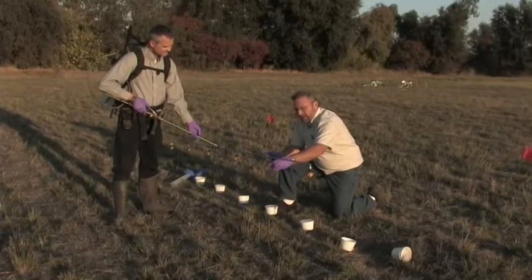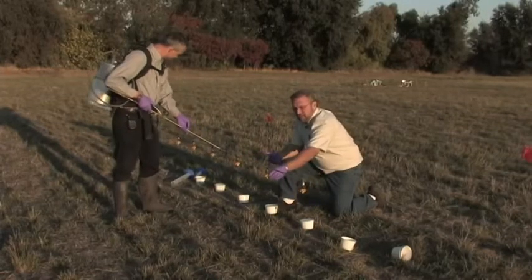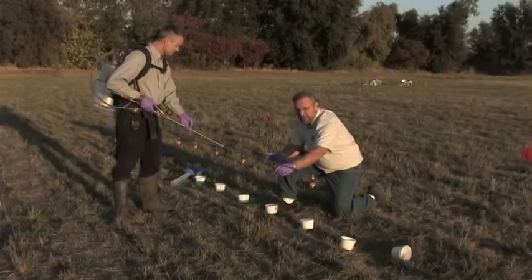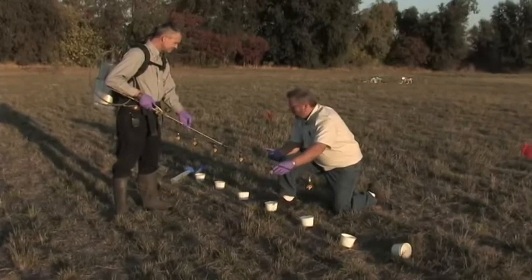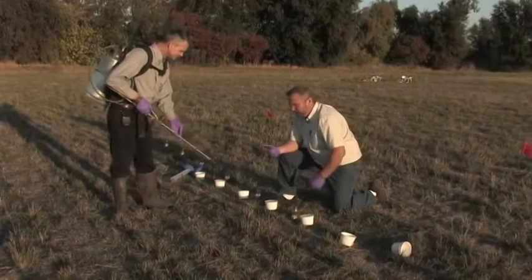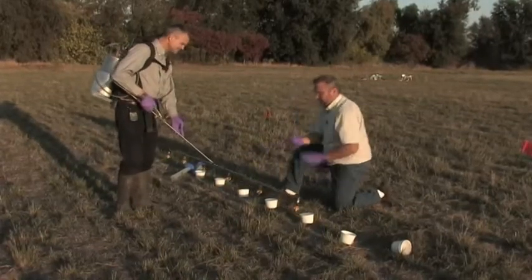What we're going to do now is take volume from each of these nozzles, because if one nozzle is not spraying or is spraying too much, we'll get either an over or under application. Guy is going to be spraying here and we're going to gather the volume for 15 seconds.